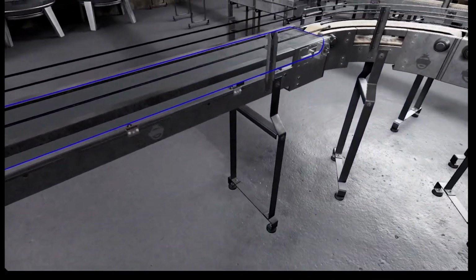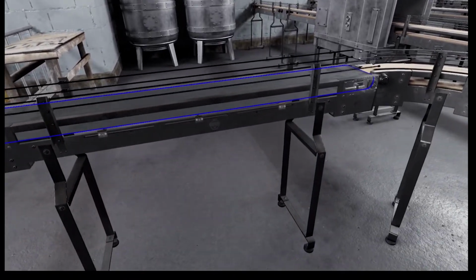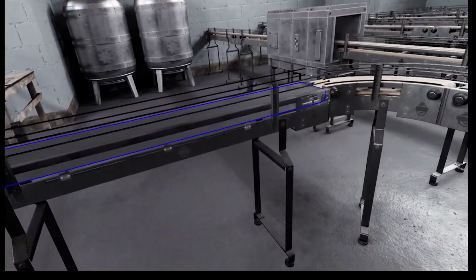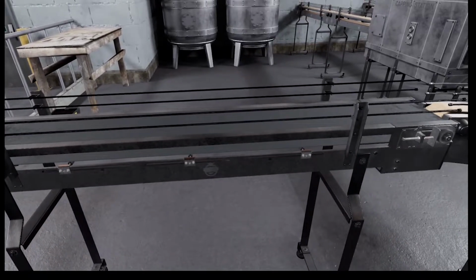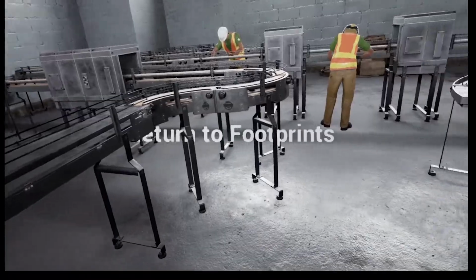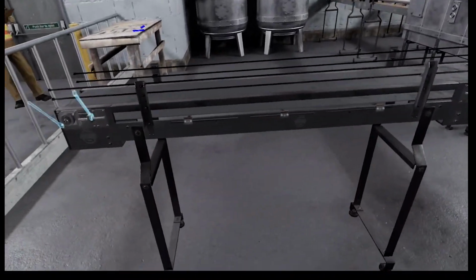This could have been resolved through preventative maintenance. We will need to complete an incident report later. Walk around the conveyor belt now to look for the source of the problem. You found it. Excessive slippage. Great work. So the problem is that the drum was slipping and caused the belt to slip to the left.